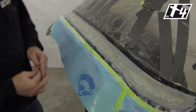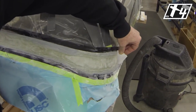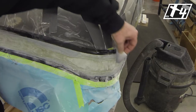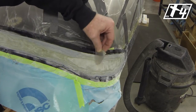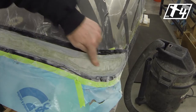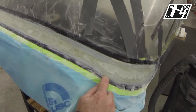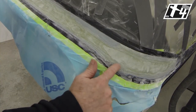Over here on the side, you can see it's got a little ways to go still, but we've started working down towards being a flat surface projecting from the canopy out into the skin. That carries up into here and then it's finally starting to turn into an inside radius, which will remove a little bit more of the peel ply texture in this low spot once we start getting some of the final contour established. Right here along the bottom tape, you can still see areas where there's still some resin and even a little bit of glass bridging out onto the tape.